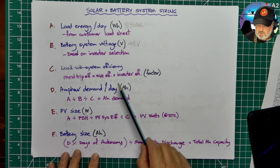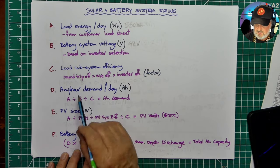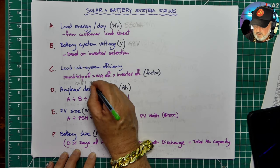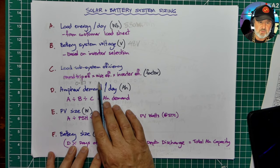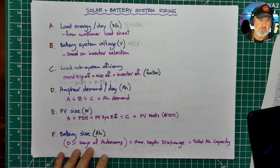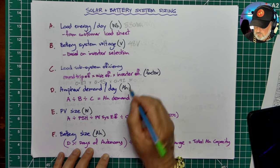So I'm just going to pick some typical numbers in here. If this was a lead acid battery system, the efficiency's not crash hot, so it's around 87%, which is a factor of efficiency of 0.87. We multiply that by the efficiency of our cable system, so we're allowing for up to 5% loss in our cable system, and for inverter efficiency, battery inverters are generally lower than solar inverters, so I'm saying around about 92% efficient. And you just multiply all of those through.